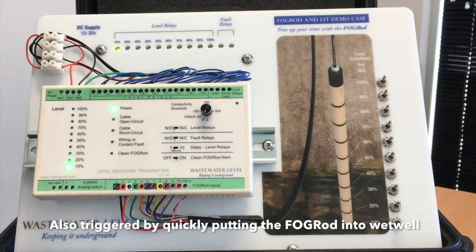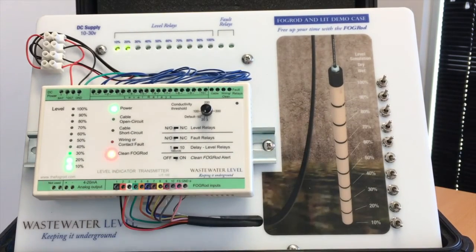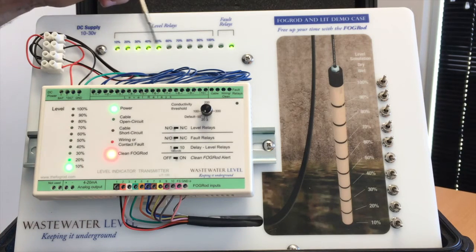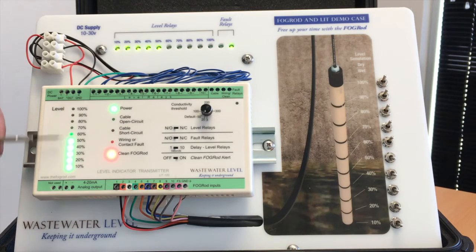The first thing that happens is you have this switch in the on position, you put the rod back into the well, and when you do you see this start to flash. In the case of production units it takes three minutes before it latches, so you're sitting there looking at some level and this thing flashing and you don't know why. After three minutes with the production unit the relays will come on, you'll start your pump. This fault goes solid, which means it's latched, and these level LEDs are flashing. It's just because you put the rod back in the well — that's a very fast level change and the LIT says there's some concern there.